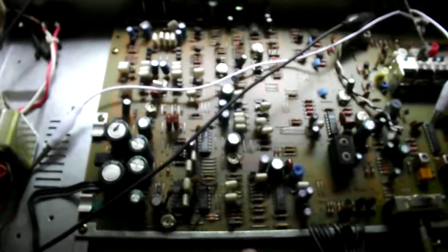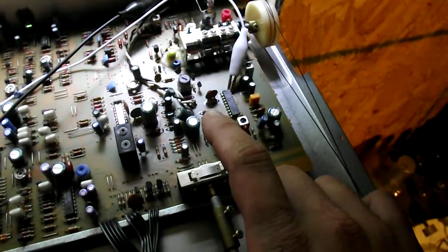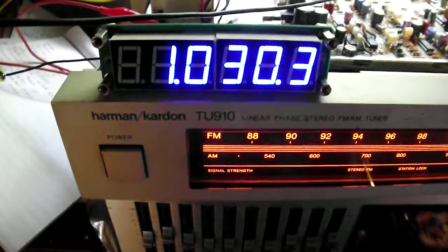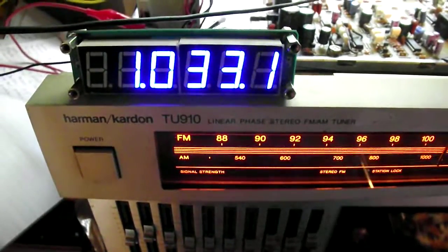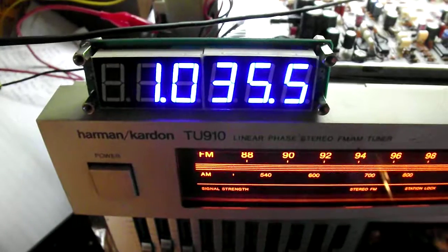There's no digital circuitry in there. It's a four or five gang tuner with a whole lot of discrete components for the FM section — that's going to be complicated and I don't have the tools or the sweep generator to align it yet. But if you do any kind of AM DXing and you hate having the limitation of a digital tuner, this is a really cool thing you can add on, because now you know exactly where you are without having to deal with not being able to fine tune. Especially with this tuner, some signals come in better offset a little bit, but that's weak signals.